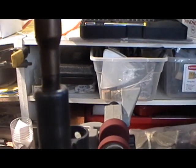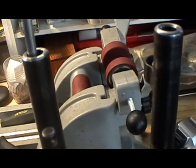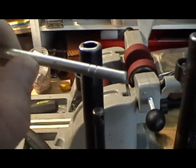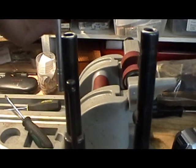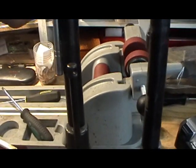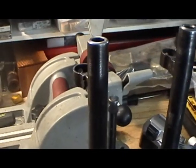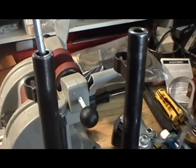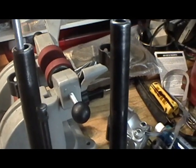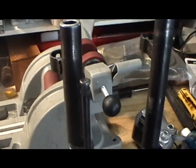You'll probably still have a good shootable rifle. I'll take my cleaning rod and stick it down in here — you can feel where it stops. That is how far down the barrel is counterbored. Probable reasons for counterboring could have been improper cleaning with a steel cleaning rod, not using the muzzle protector so it rubbed up against the inside of the crown, damaging it — or it was simply drilled out where the rifling had worn.